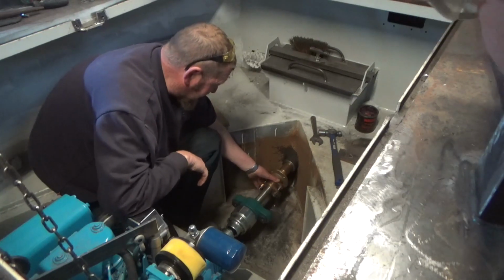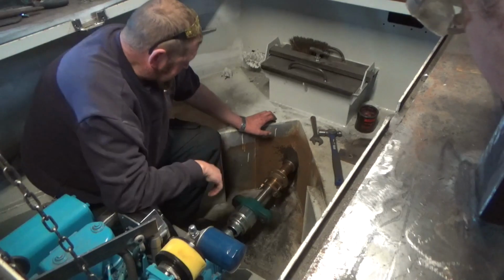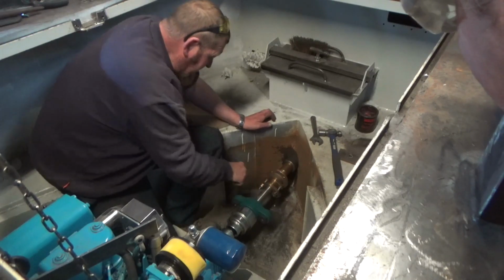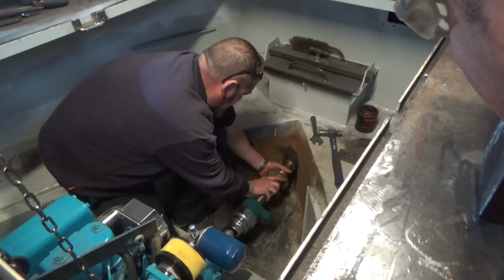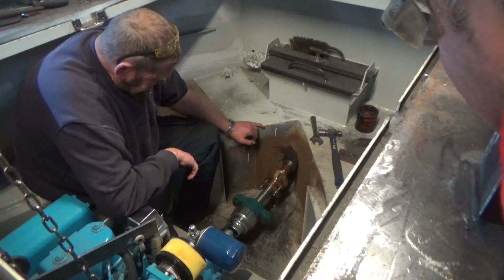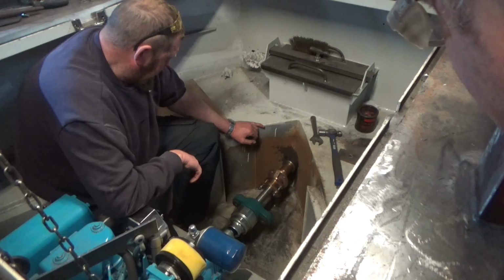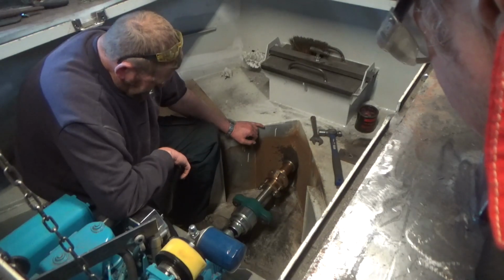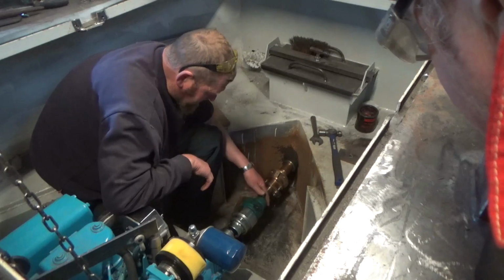You put that all in that plane, and everything's easy to get to, isn't it? Apart from these two under here. That's upside down, I know. That stern gland. There's a grease point on it. There it is. That's what squeezes around your packing. Cracking bit of kit.